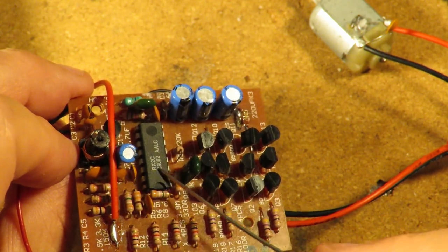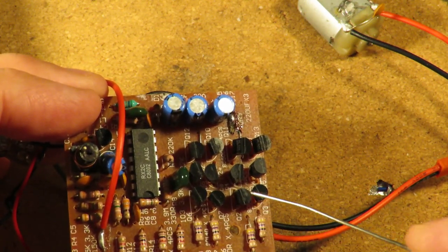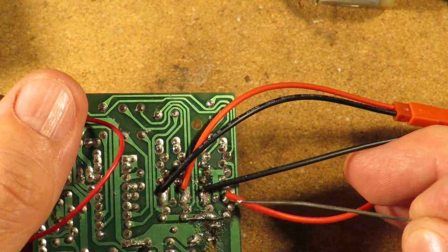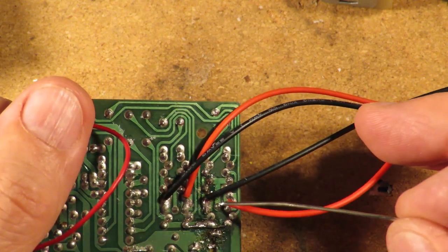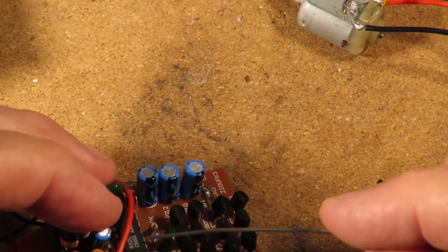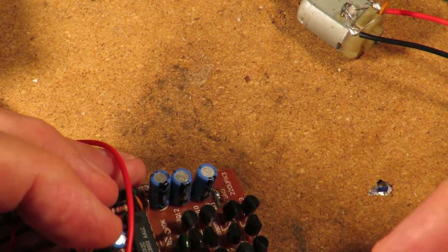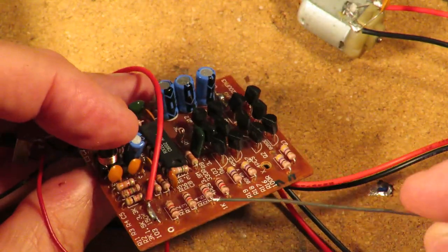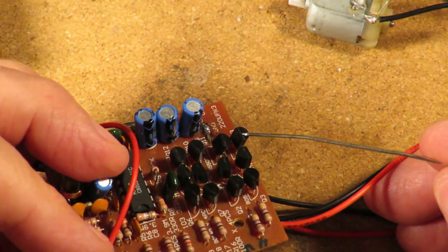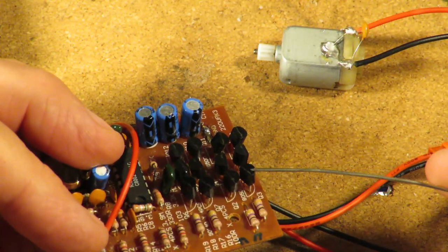That's still working fine. All that's happened is I've drawn too much current and it's killed two of these transistors — the ones that actually connect the positive rail through the motor to the negative rail, so that they actually switch the full battery load. Whereas the actual circuitry itself is only running on about 3.3 volts — somewhere in there there will be a voltage regulator to drop it down to 3.3 volts. But the only bit we're really interested in is at this end, where the transistor just switches on and off the power to the motor.